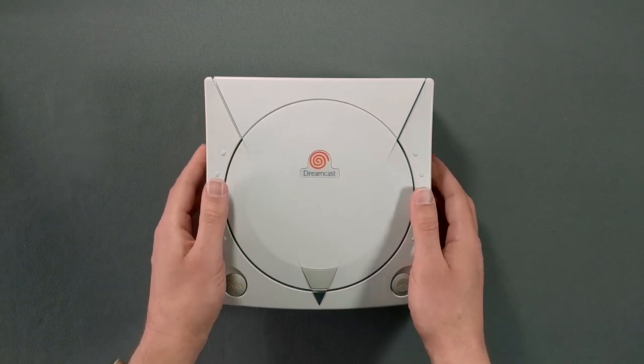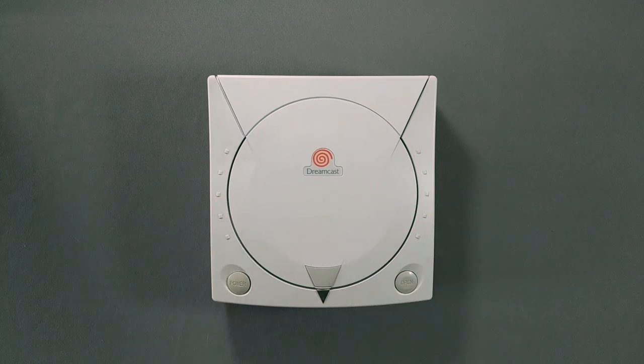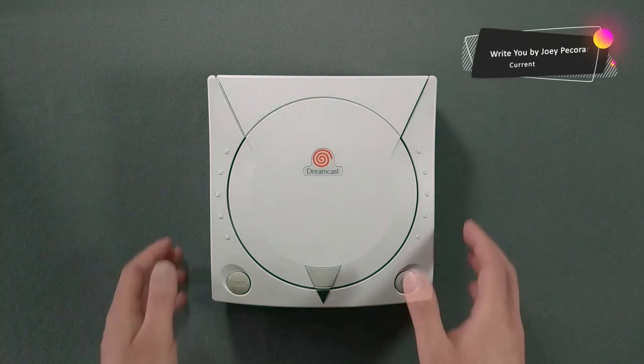Rather than simply replace the battery today, we're instead going to revise this system by installing a battery holder in its place. That way, we can install a new rechargeable battery, but we won't have to grab the soldering iron in another decade when this battery inevitably wears out.